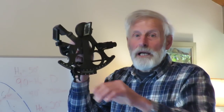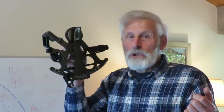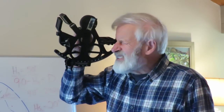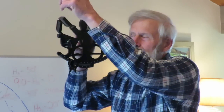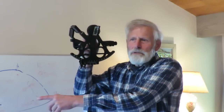Mark! And either you're doing it yourself with a stopwatch, you push your stopwatch right when it touches the horizon, or you say mark, and your partner records the exact time that you said mark, when it touched the horizon. Now, one of the problems with a sextant is if you're holding the sextant at a funny angle, you're not measuring accurately the height of the star. You're measuring from up here down to a point over here, and you're getting too big a reading.